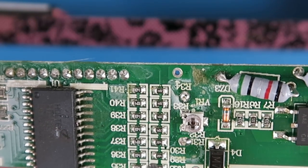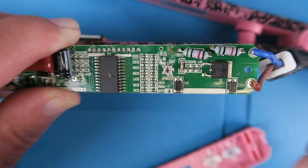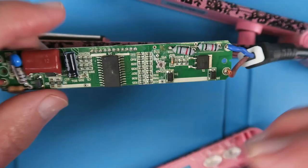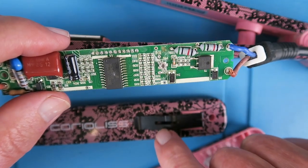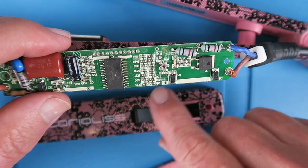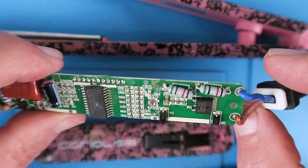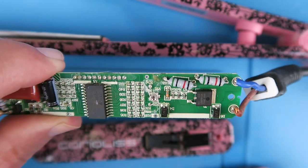Clearly moisture has come in here. I'm guessing this little potentiometer is for calibrating the unit, and these little resistors would be voltage dividers for each of the temperatures. I noticed also that in the case there is a small hole which cunningly is directly above the little variable resistor - clearly that's how it would be calibrated after assembly. Unfortunately, any drip of water there is going to drop straight through onto the variable resistor. It's possible there is some corrosion or at least dirt on that component.